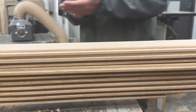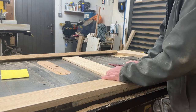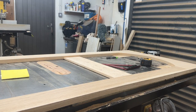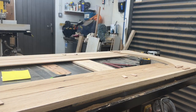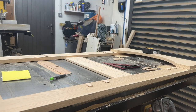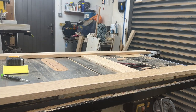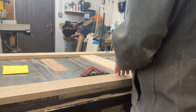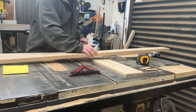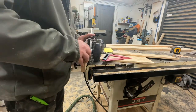After machining everything, I just need to take a little off the infill with the drum sander to get to final thickness, then do a bit of setup to get the Domino position right so the head, rails, and stiles all work in terms of dimensions. Once I'm happy it's the right width, I do a dry fit with bits of infill to make sure everything will work together. The project's coming together — looking really good and I'm starting to get excited.